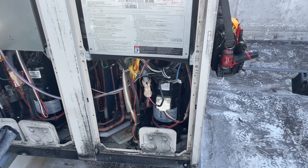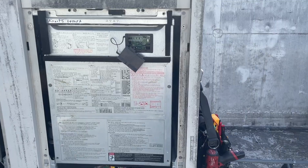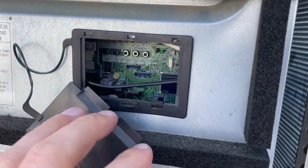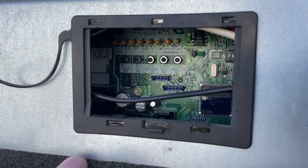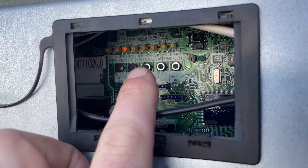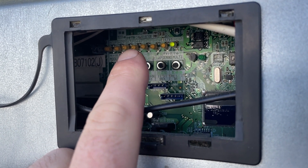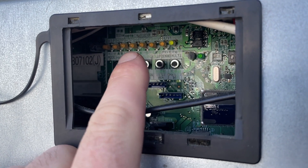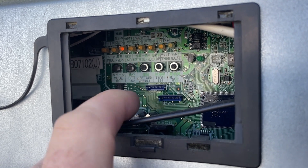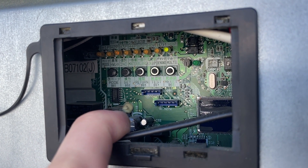The first thing I'm going to do is show you how to get this thing in vacuum mode. Now these LEDs are horrible — they used a resistor of too high a value and that's why they're so dim. It's a bad board design. The ones that look like they're flashing, that's just the camera refresh rate — these are actually solid.